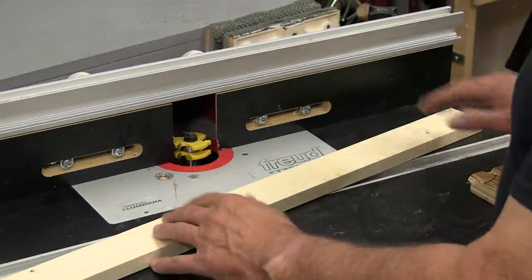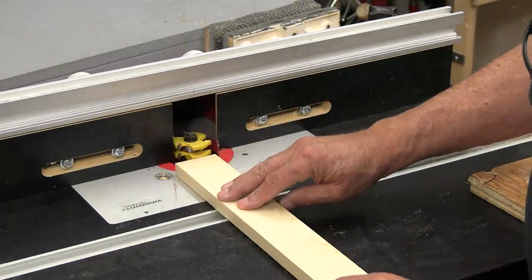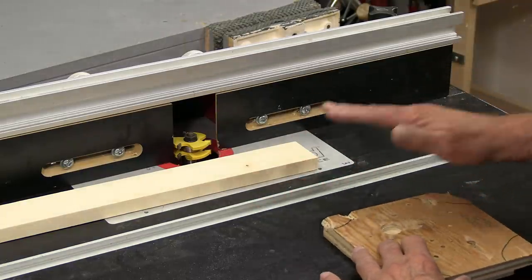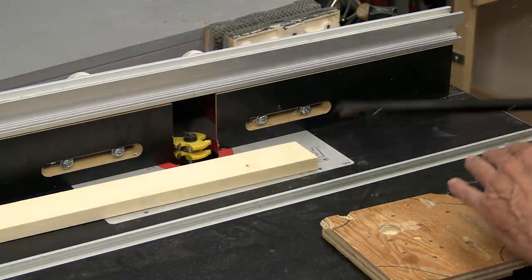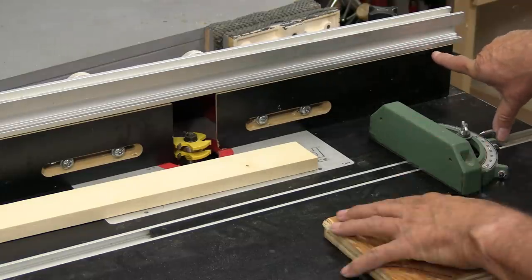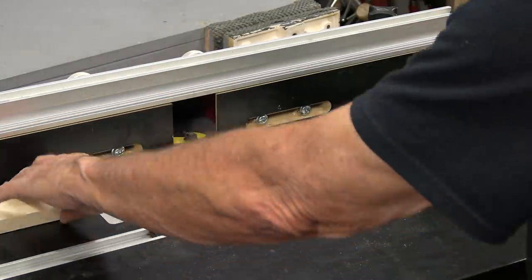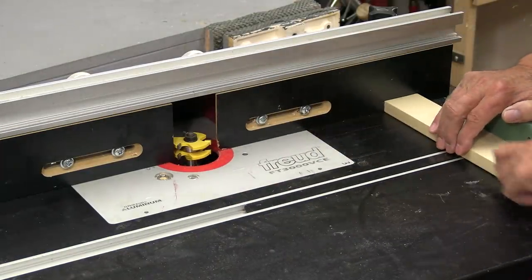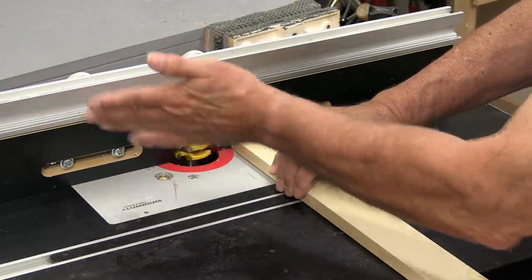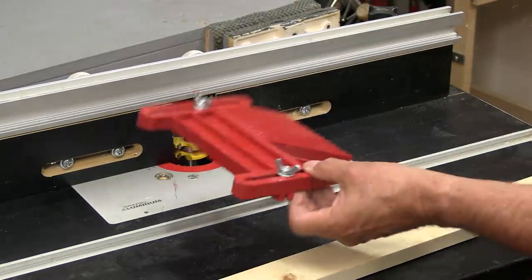I've moved over to the router now. If you've been using a router table, you know that we run wood long grain and also short grain. Now if you're new to routing, you will see what looks like a miter gauge slot. It's not for a miter gauge — we never use miter gauges on the router. When you put a miter gauge in there, it's very difficult to align the fence perfectly from one end to the other. I've seen all sorts of contraptions and none of them work. When you start pushing wood through, by the time you get to the end it's starting to bind or it's off, so it's just not a good idea. That slot on router tables is for feather boards.